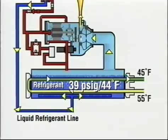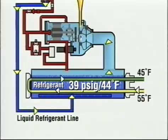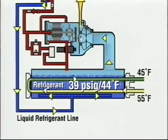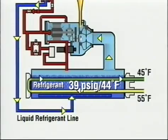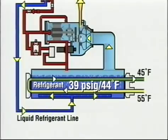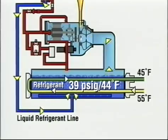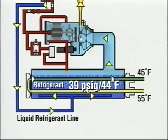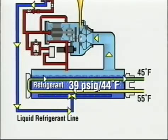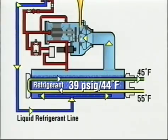The entering chilled water temperature is not controlled by the chiller. It is the air handlers or load supply that will send out the water at a temperature that's based on the load in the building. The 55 degree Fahrenheit temperature is the full load entering water temperature that the machine will be able to pull down to 45 degrees Fahrenheit at the designed condenser water temperature. The chilled water is distributed to fan coils which cool, dehumidify, and filter the indoor air.